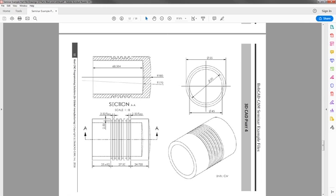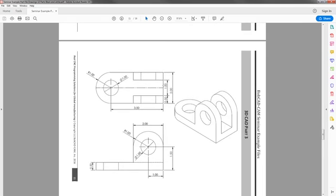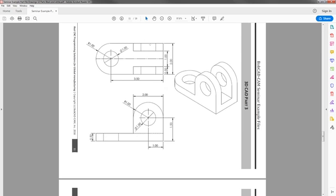This one's kind of goofy because it's got this front radius on the front here and on the inside of a radius of like 180 centimeters. So it's a real shallow little radius. There's a trick to that one. We'll draw that one out sometime. But a lot of these parts you can draw with that same kind of method. If I drew out a rectangle that was big enough for this, I could start offsetting my lines or paralleling my lines and then turn it into a solid model.